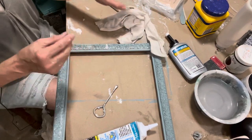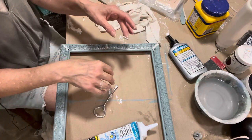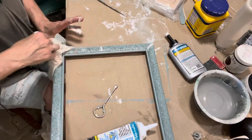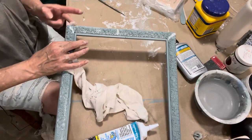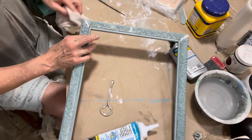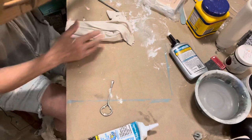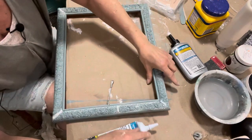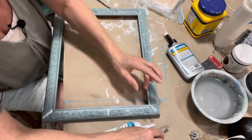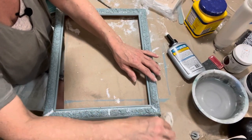So what I do is take a long nail with the flat head on it, and I put it down there, and I tape it, trying to use plumber's tape or electric tape, something that really binds on there. But if you don't have that, masking tape, packing tape, anything you can use to help keep the air from getting there and drying out the caulk. Because caulk's not something you use every day, so it's usually a while before you're revisiting it.